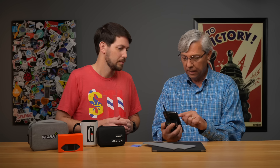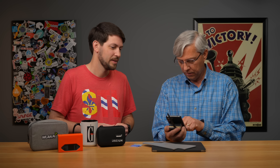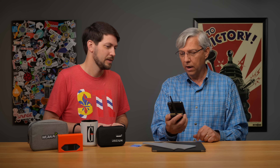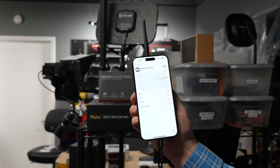Sometimes you want to know channel utilization if you're in a crowded area. Then you can select a channel and it has that find-my feature. I remember back when Wi-Fi first came out, CBS had a guy who would travel around to visit stations carrying a cheap thing that would detect RF at 2.4 GHz to find them. But this one literally comes up, locks in, tells you the signal — you can turn the sound on or off and walk toward it. It gets faster and faster as you walk near it, and then it becomes a solid tone. For every SSID you can get every bit of information through the radio, and you can also do a spectrum analyzer and see the waterfall for the whole band.